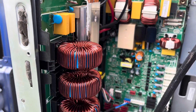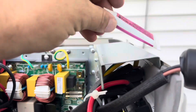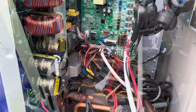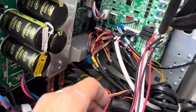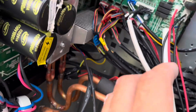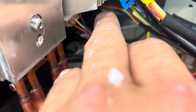The new board is set. Now it's just going to be a matter of hooking everything back up and getting all the screws back in. They didn't send any new heat sinking paste, but I carry some — it came with a Fujitsu board. So I'm going to put some new paste on this before we lock her down. I think I got everything landed back. I had to go back to the schematic — one was the chassis heater, one was the crankcase, and I had to make sure I got those in the right spot. This one's the reversing valve.